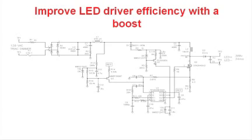That impacted the efficiency and cost of the power supply. Recently, some LED manufacturers have realized that a better power system might result from going to a higher voltage LED. Products are now available at 50 volts, and if you series-connect several of those, you can get to a requirement for a 300 volt output power supply. In this case, the output voltage is always higher than the input voltage, so you can use a boost regulator. With the boost, the currents are down — in this particular case, we're only supplying 34 milliamps output current — and that's really why you can improve efficiency with this circuit.